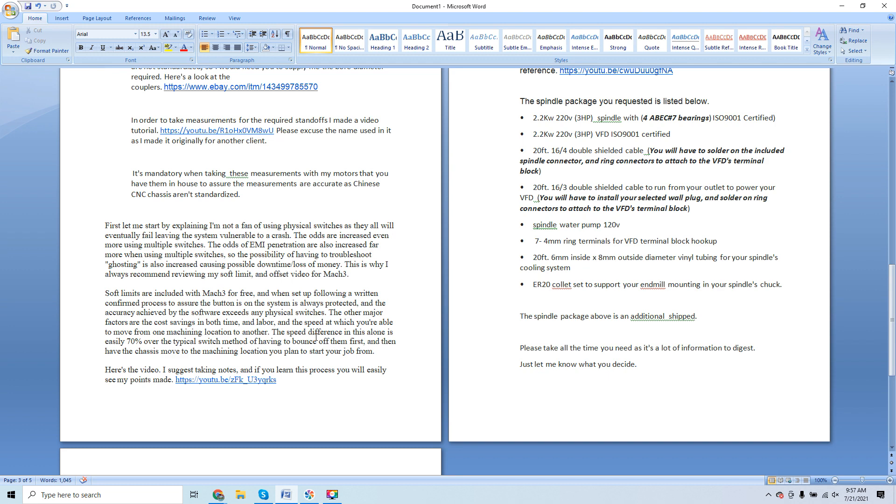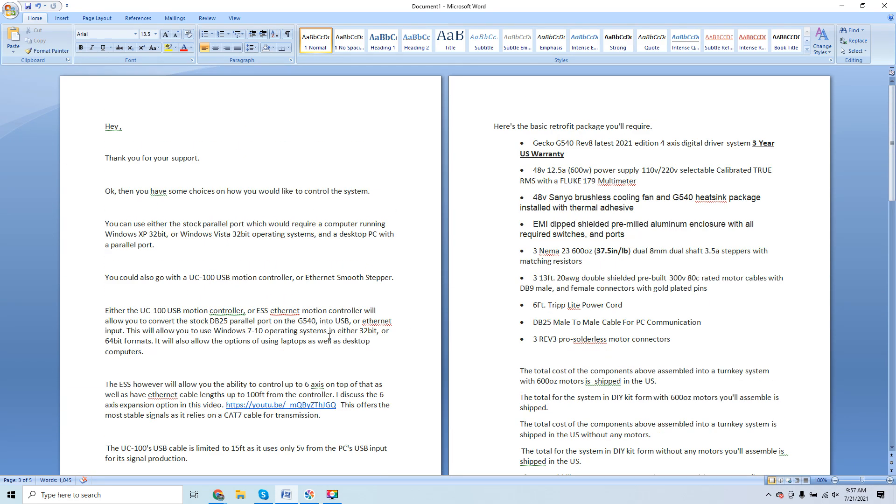The soft limits button must be green and highlighted as shown in the video tutorial. I still get messages from guys having trouble — it's usually because they're using hack software or Chinese Mach 3 registry patches. If you use a retail version of Mach 3 from ArtSoft or a legal vendor and set it up as I show, you'll truly see the power of soft limits. Over 900 people left likes and around 100,000 have viewed the video — which tells me out of 100,000 people, about 900 really got it.